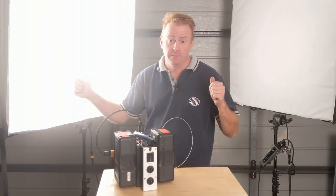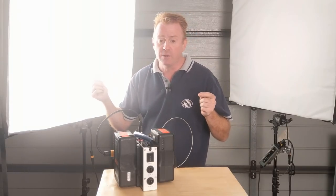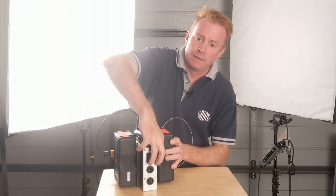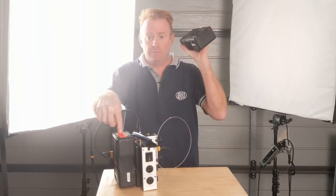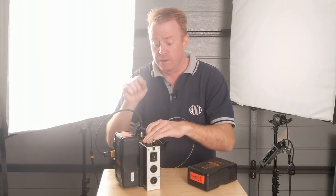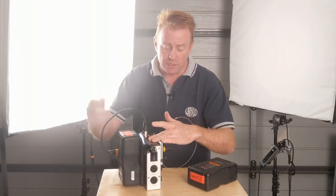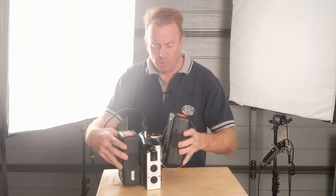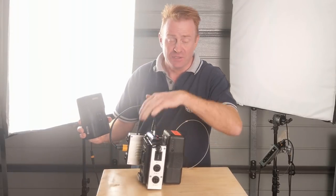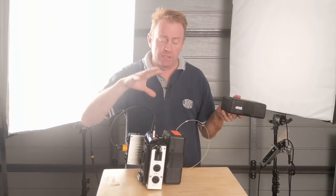Here's where this is really genius. Let's say I'm running this handheld — it weighs less than three kilograms so I could walk around holding it. If I'm running it at less than 50% brightness, I only need one battery. A 48 volt system running off a single 14.8 volt V-lock — that's how clever this little box is. And let's say I'm running for long periods and need to swap batteries while dimmed — no problem, we can hot swap the batteries. So that's where this is really, really genius.